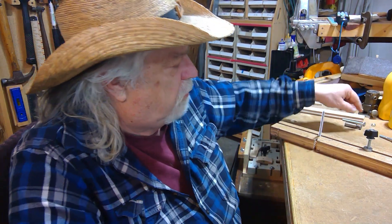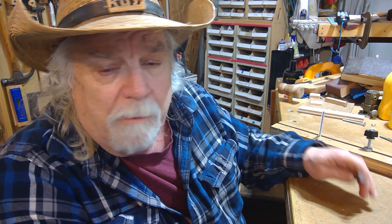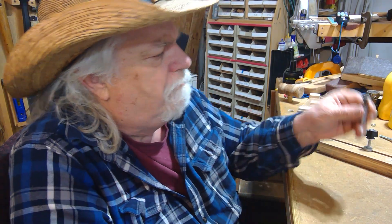The t-bolts do slide nicely and sawdust doesn't build up in these — it's usually not a big issue, so it works really well. But what I was showing everybody is that you don't have to buy this bit to get really good working t-slots. You can do it with hardware and scrap wood that you have around the shop.